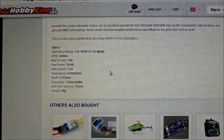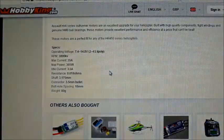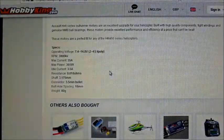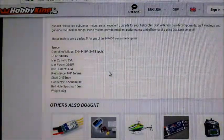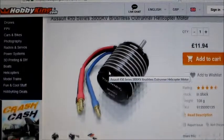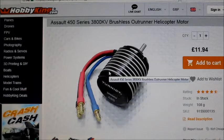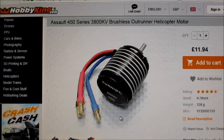So it's got 4mm bearings but the end has been turned down to a 3.175mm shaft size. That unfortunately means I can't do what I originally planned — making a standoff mount for a 64mm EDF — unless I use a 4mm shaft all the way through and modify the rotor adapters, which isn't always easy. Anyway, let's give it a try, see how far I can push it, check the temperatures, and see if it'll turn any sort of sized prop.